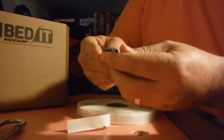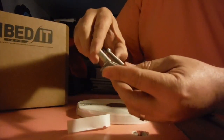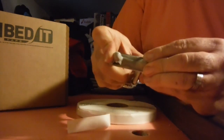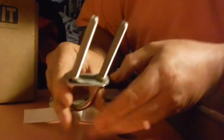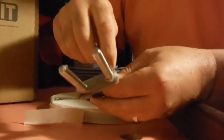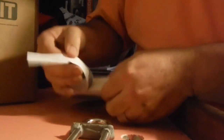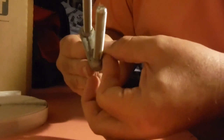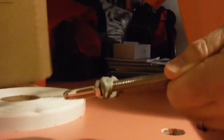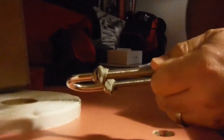At this point you just want to put it on the back of the base or the backing plate, whatever you're mounting it to. We want to test it and make sure we can push the bolts all the way through the butyl tape and all the way through the base. Once we have the base covered, we want to make a little play-doh snake — roll out a little snake form and wrap it right around the bolt. The purpose behind that is it's going to push down into any kind of chamfer or countersunk hole where you're mounting it through. You can see I'm applying a little bit more in a section where there was a gap. You can see it's got a good solid cover and it's a little bit thicker right there around the base of those bolts where it's going to go through the mounted surface.